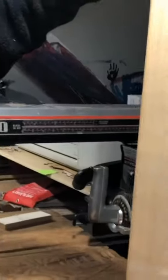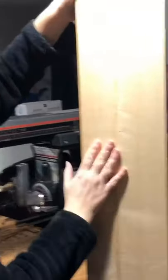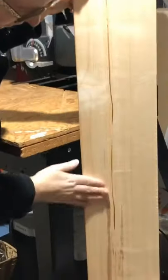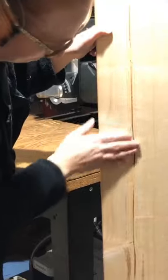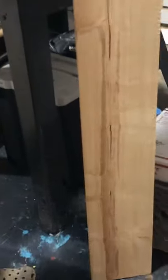Beautiful cut board. So it's got some rough patches at the top. We'll just sand this off a little. And then there's a couple of little rough patches here. So I'll just take some 220 grit, a little hand sandpaper, and give it a little rub down on those spots, and then we'll put some stain on.